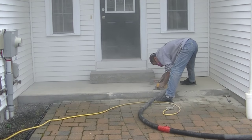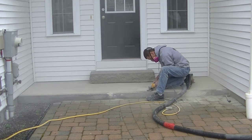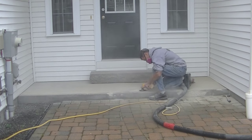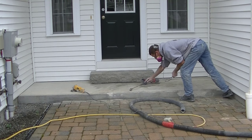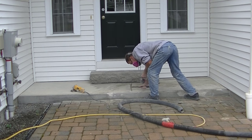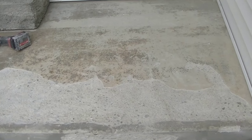When we repair concrete, we've got to make sure we get it all off. We don't want to be coming back in a few months to redo it. That concrete was just kind of exploding off as I ran that grinder over it — the damaged area just kept growing and growing, it seemed like. Sometimes that happens; you just got to be prepared for the worst. I'm sounding it out to hear if any more sounds hollow. There's a little piece right there, so I'm just chipping that off. It just takes a little bit of time. The prep work is really the most important part of repairing any type of concrete.